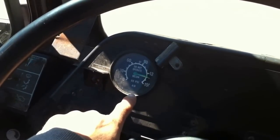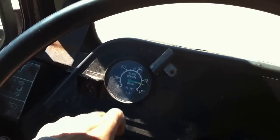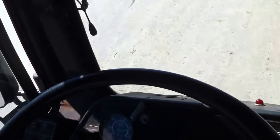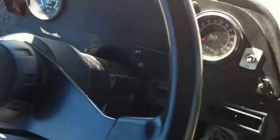And the dryer just went off at 125. Both needles are stable around that mark there. That is fine. At this point, we will stop the engine from turning. We will remove the emergency brake. Cover the brake. Do not apply. Cover. Wait for the air to stabilize as it's descending.